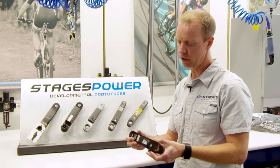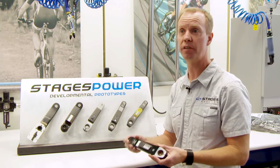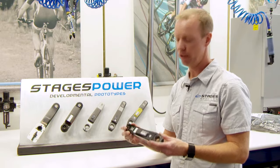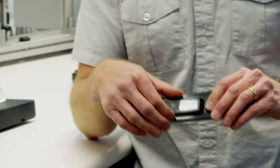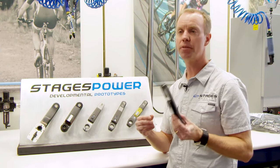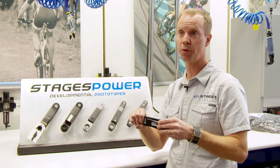What's really unique about the product is that it's actually less than 20 grams — it normally runs between 15 and 18 grams — and that includes the battery and everything you need to ride the device. The other really nice thing is that you just bolt this crank arm on and that's all. There are no magnets, no secondary product that goes on the bike to enable it to work. Everything is self-contained within the body. We have sensors on here measuring elements from this device; the strain is measured by strain gauges in contact with the metal, measuring the load or pedaling force going through the crank.